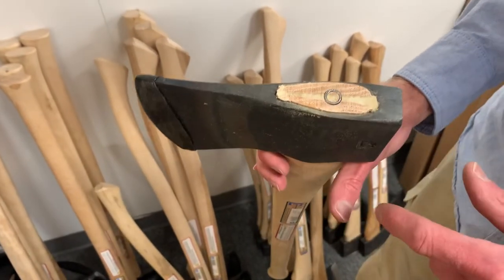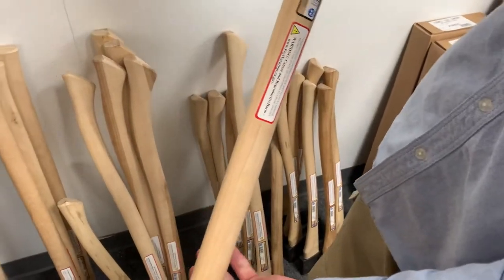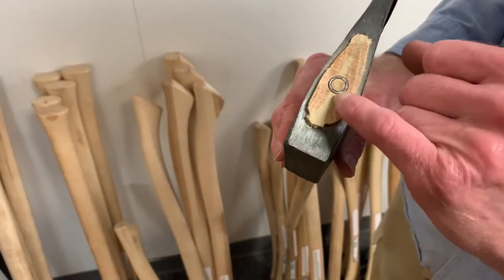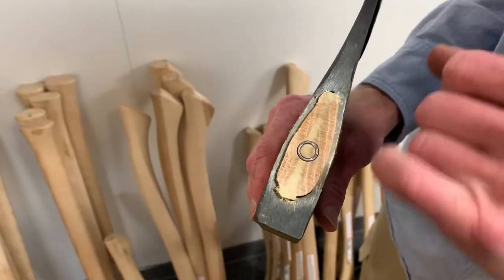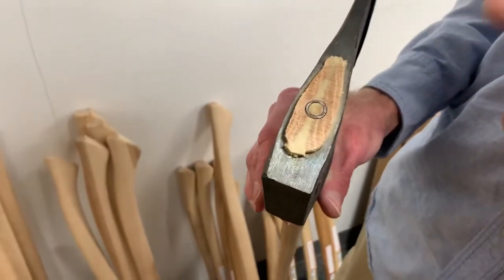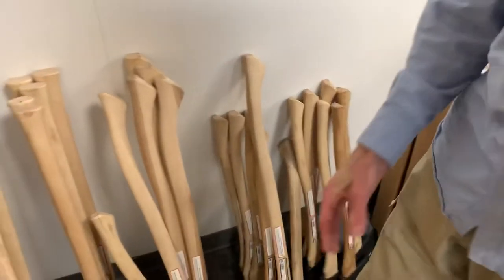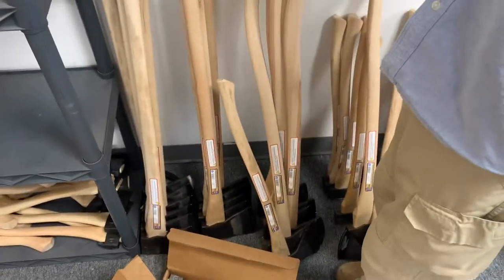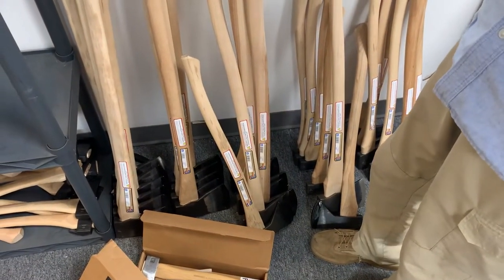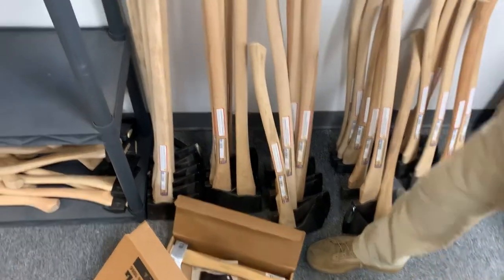Back to a round wedge — that's straighter-ish at that end. Remember what I said about the elasticity of the wedge wood? See how compressed it is here versus there — that's why you don't just use any old piece of wood for the wedge. They used to use aluminum in these, and aluminum doesn't compress at all. Those are really tight the day you get them, but with some vibration, a lot of those came loose. When I say a lot — somebody would call maybe once a week to say their head had come loose after a couple months. I hated that and quit carrying the aluminum-wedged ones.